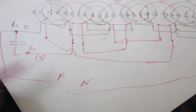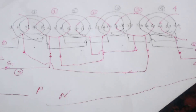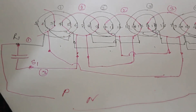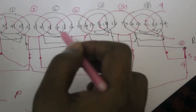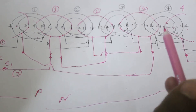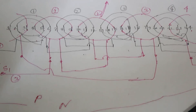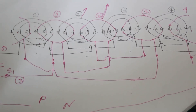Most importantly: the running side carries the greater phase. If you connect the phase incorrectly here, the motor will be damaged. Be very careful with this rewinding. You must correctly identify the running and starting coil terminals. The starting coil resistance is always higher than the running coil, and the running coil resistance is always lower, because the starting coil uses thin wire and the running coil uses flat or thicker wire.